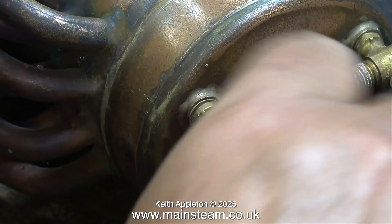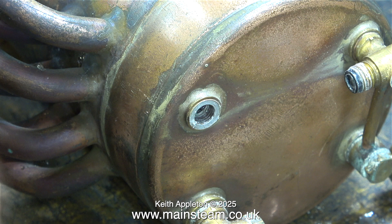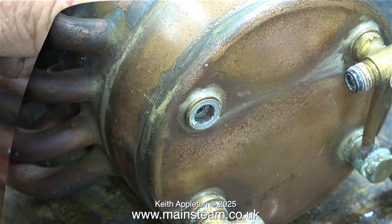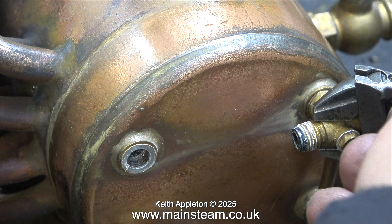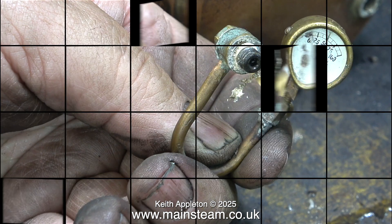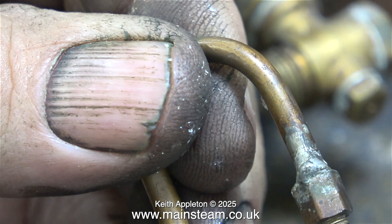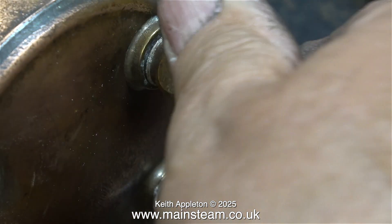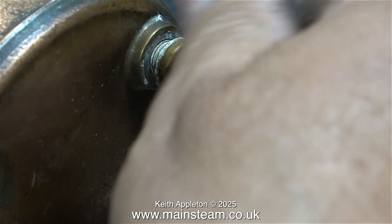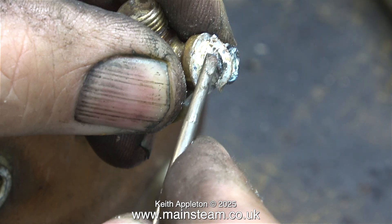The pressure gauge and siphon are just scrap. But the good news is the water gauge fittings were much easier to remove than on the 501 boilers. And here you can see that this fitting is 100% blocked with limescale. The water gauge upper fitting also unscrewed fairly easily from the boiler bush. The pressure gauge glass is cracked and it doesn't look too good inside, and also the part has been repaired with soft solder. Although soft solder is okay for small steam toys, it's no good for boilers like these running at a higher pressure. When I look at the thread in the bush, which is larger than on the 501 boiler, the thread is looking in good condition.